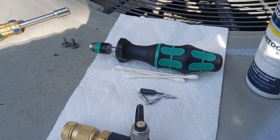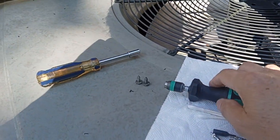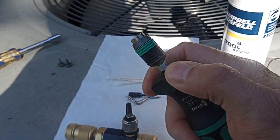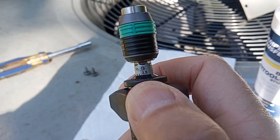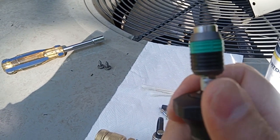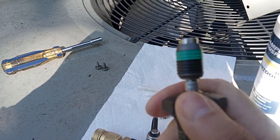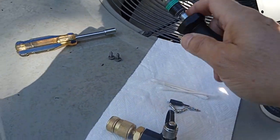And I'm not going to finish this system and button it up and walk away with leaks — I'm just wasting my time. This screwdriver I bought from McMaster. It goes from two and a half to 11 inch pounds. Pull the handy-dandy collar back and rotate it, and the stem comes out and reads inch pounds. So I'm going to set that for about three and a half — maybe just a hair more, between three and a half and four and a half.